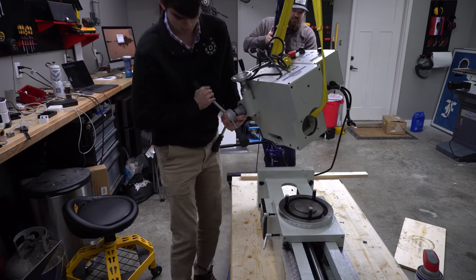I went with 72 volts because my motors could handle it, and I'm eventually going to switch to servos, which operate in that voltage regime. The power supply feeds three beefy stepper drivers. The model number of these drivers is DM860T. They can supply up to 7 amps. The step and direction signals for the stepper drivers come from a Mesa 7i76E.